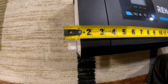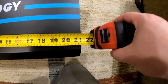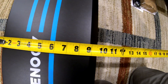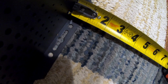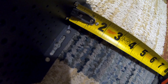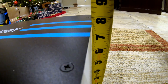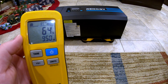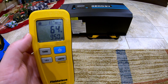The inverter charger, including those wired glands, is approximately 21 and 3/4 inches long. Here on the top we're approximately 9 and 3/4 inches wide. We have these little brackets down here on the bottom, and they're approximately 3/4 of an inch — same on both sides. It's approximately 7 and a half inches tall. And it weighed 64 pounds 9.5 ounces on my scale.